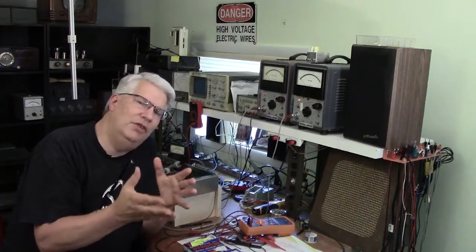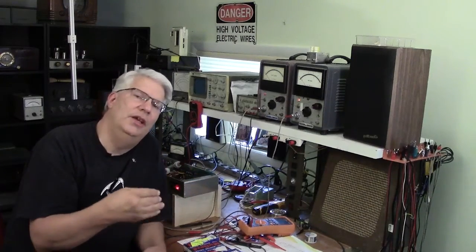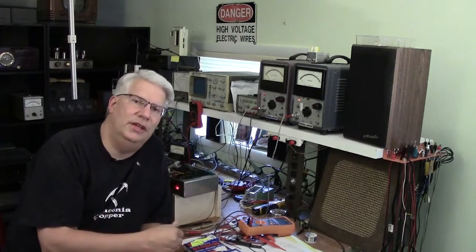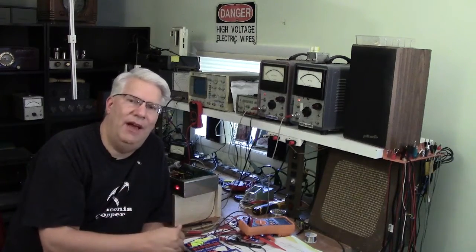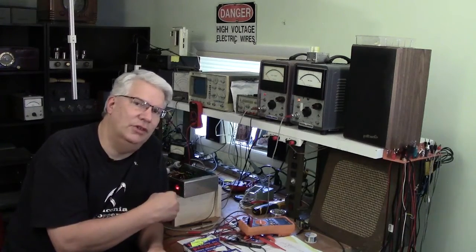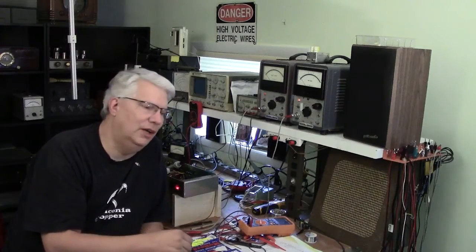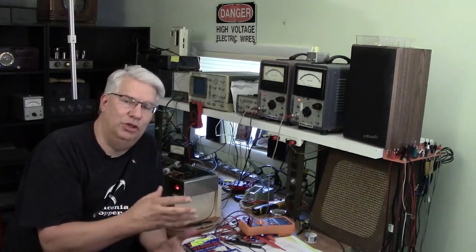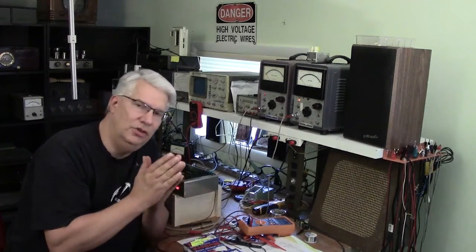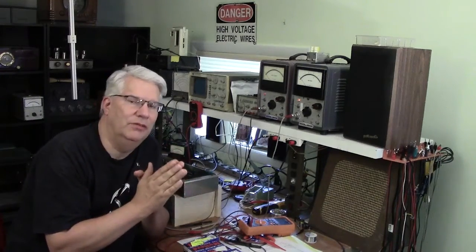Well, what if you continue to run the amplifier in that fashion? What ends up happening is that constant DC through one half of the output transformer may end up permanently magnetizing the transformer, at which point you'd have to run it through a degausser and kind of clean it up. So it's really good to have your push-pull amplifier tubes aligned from the DC bias perspective.